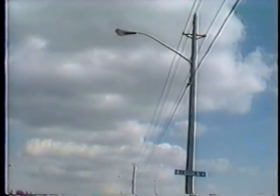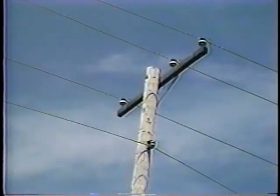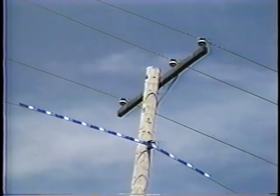First, distribution lines. The distribution line runs a distance of typically 10 to 30 miles. The conductors may be delta connected, that is, with no neutral, but more often than not, they are Y connected with a neutral running along the same support structures. The loads across the three phases are often out of balance, so that some current normally flows along the neutral.